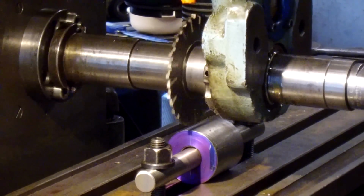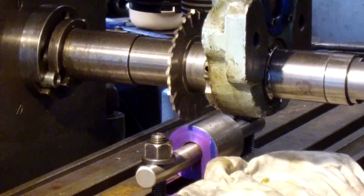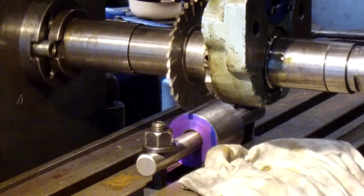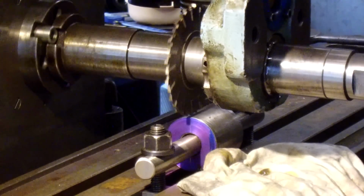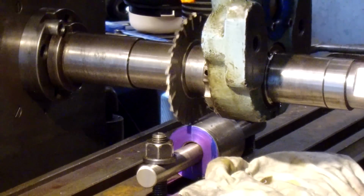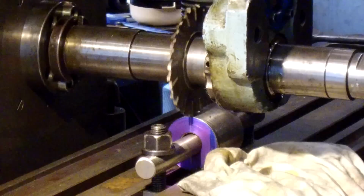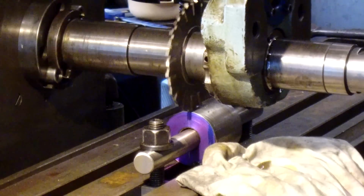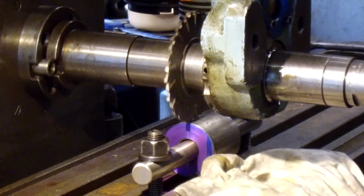We're going to throw some oil in this bearing here manually. Let it drip there. Okay. Pretty big diameter come down with a little cutter, so we're just taking it real easy. Okay, we're just touching it now. Okay, and all we want to do is make a flat that's as wide as the cutter, and we're pretty close to it right there. And we're just setting zero on our dial. We know we're going to be going quite a bit.